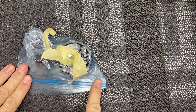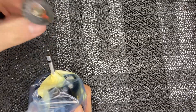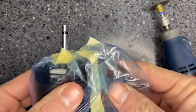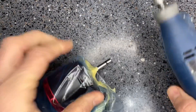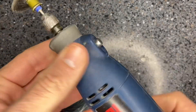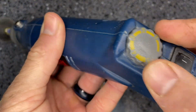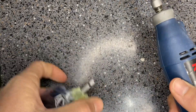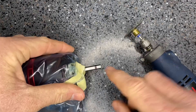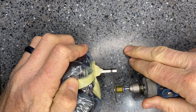Your motor is protected and your bag is sealed off. Now we're going to grab our cutoff wheel on the Dremel. We have our Dremel — this is just an old Ryobi Dremel — and our Dremel brand cutoff wheel. We are going to set it to about speed three. We're on a granite countertop so we can cut towards it. Line up to where the flat spot is up, take the Dremel, and start cutting.